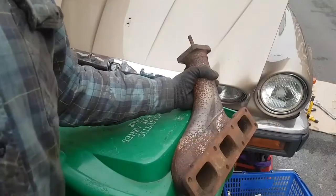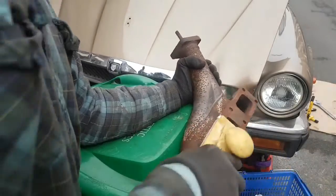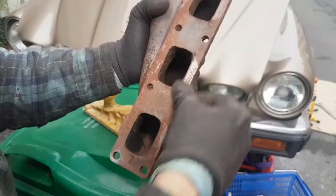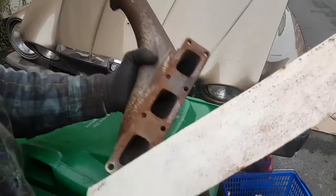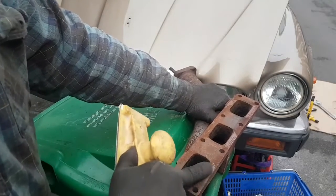I could be cleaning this up for a good hour I'd imagine. This is a body file - it's very flat. I'll keep sanding until it comes up completely shiny, the whole lot. I won't leave any pitting - there's quite a lot of pitting there. Actually this might prove to be enough - it is sharp, but we are dealing with cast iron, so it's quite pitted.